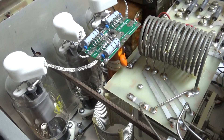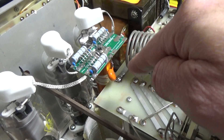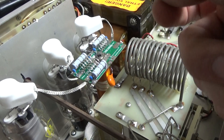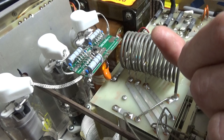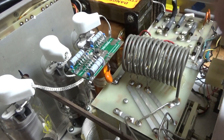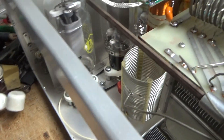Added a longer lead between the plate tuner variable cap and the trace on the board — it now protrudes through the board through the trace, and there was a nice nub to solder onto and it soldered really well. Before, it was like maybe going through the board but not really going through the trace, so it was getting really hot and eventually opened up — just bridged by solder.